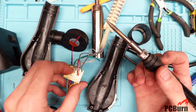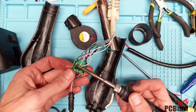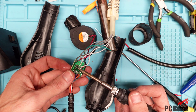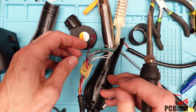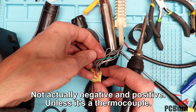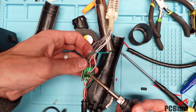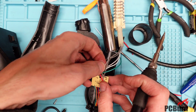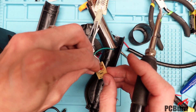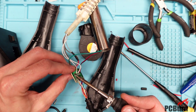I think I may have erred slightly here. I just popped it into this opening because that's what it was sitting in when I opened it up, but I think that might not be the case. Looks to me like it should probably go down here, looking at where the other side of that cable is connected. It goes to this red wire here on the positive side. I'm guessing it wants the negative side for the other end of what I'm assuming is the thermistor. So let's try it over there. The other thing that leads me to believe that is there's solder already on the other side of this opening, so that is probably the right one.